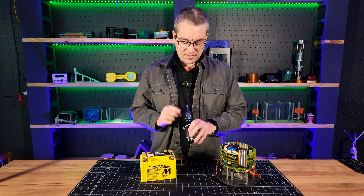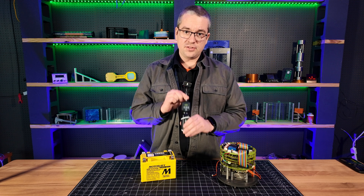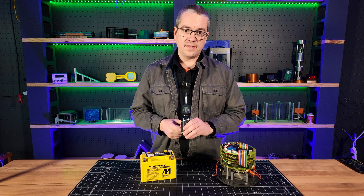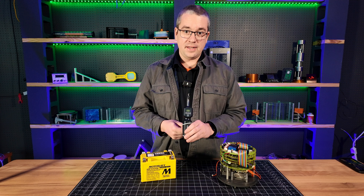So how does this work? Inside there are some strain gauges on the shaft that measure how much the shaft deforms when we torque the screw down, and they translate that into a calibrated torque value on the screen, and it warns us when we're approaching and then exceeding that value.